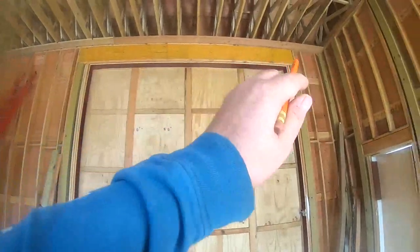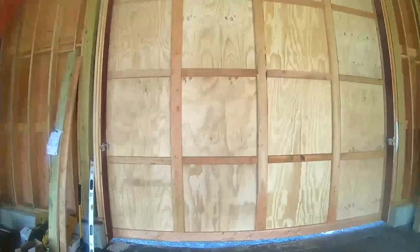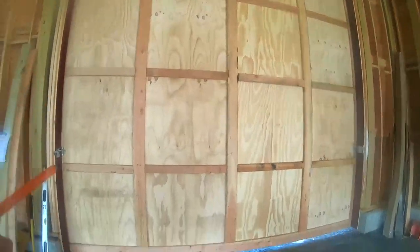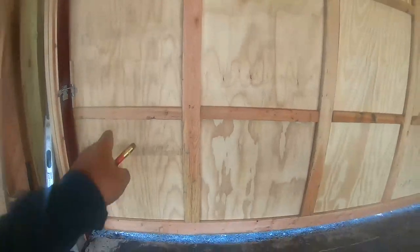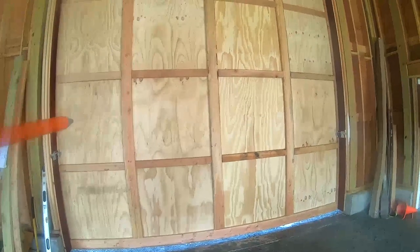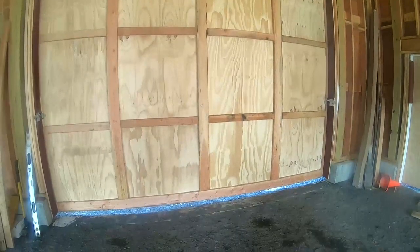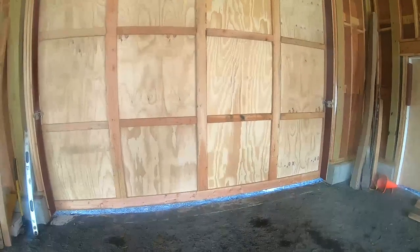Just real quick here, I made a frame around the whole door — it's out of two-by-sixes. The vertical pieces here are two-by-six, and this two-by-four goes across for support just to hold it together. After the frame was made, I squared it up, put quarter-inch AC plywood over it, and then put my seven-eighths-inch-thick shiplap siding over the front, which I'll show you in a minute.